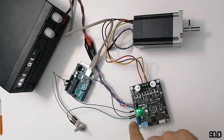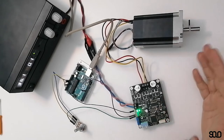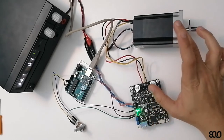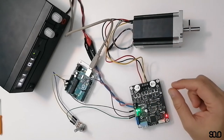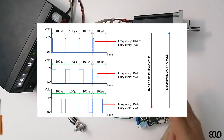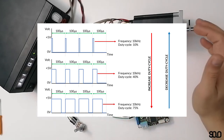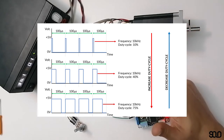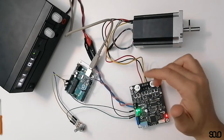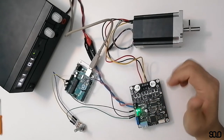The commands are either in the form of PWM pulses or analog pulses. For PWM pulses, you can send any PWM pulse with a frequency above 5 kHz — anything from 5 kHz up to 100 or 200 kHz is fine. The way to control speed is to vary the duty cycle: 0% duty cycle means zero speed, 50% means half the maximum speed, and 100% means full maximum speed.